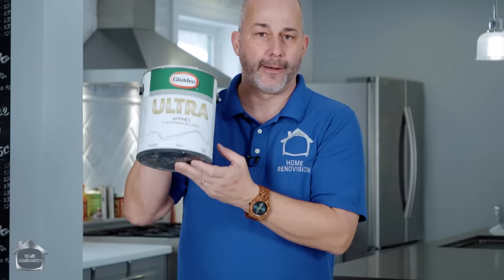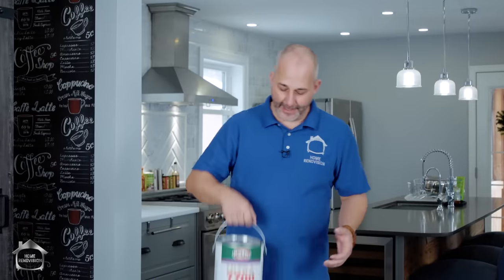For new drywall you're going to want to get a primer. I'm shopping at Dulux — we have Glidden and this is their ultra line. It's a higher grade primer than what you'll get at the box store, really good paint with high hide and lots of solids in it. Solids are the part of the paint content that reduces translucency. A really white wall is a lot easier to do a prime check on than a wall primed with a translucent primer that's mostly water. Don't pay forty dollars for a gallon of paint that's just water — get a good quality primer with high solid content. That's the secret — that's the difference between the men and the boys in the paint world.